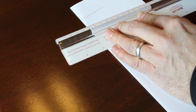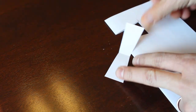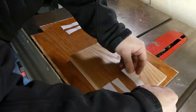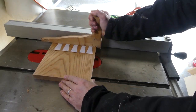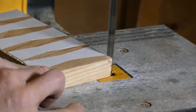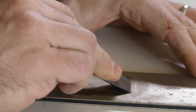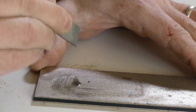With the wood stabilized, I needed to make sure the cracks didn't keep opening up. I'm making some bow ties or checks to insert across the cracks and help prevent future movement. The idea is that the hardwood bow tie has a different grain pattern and doesn't allow the cracks to open up any further. The edges of the bow tie need to be chamfered so that they'll fit a little bit more easily into their spots. And here I'm cleaning up the chisel to do that.